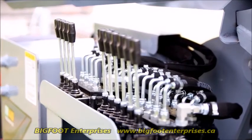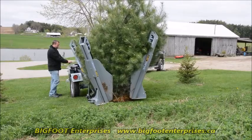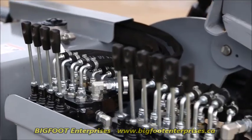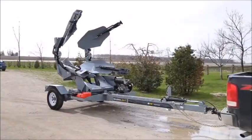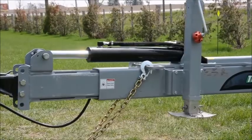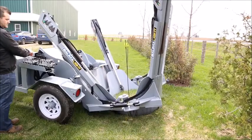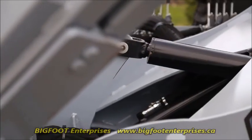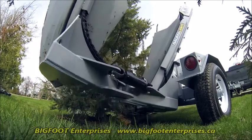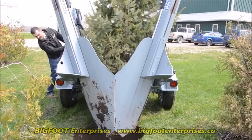All the controls of the TR440 are easily accessible and give you amazing visibility of the spading action. The hydraulic tongue extension easily adjusts the spade for the perfect distance. The two-stage tilt and lift makes sure you can put the spade base firmly in contact with the ground for confident spading and lifting. Hydraulic lateral placement fine-tunes the side-to-side position.